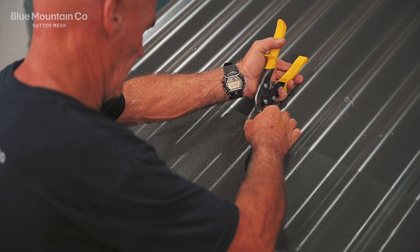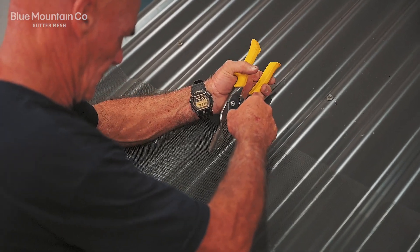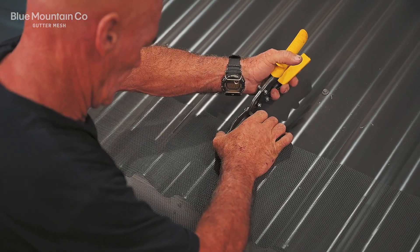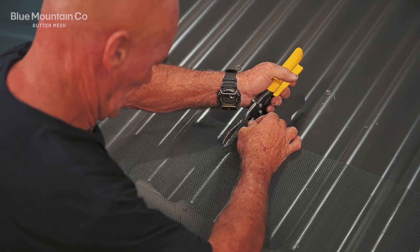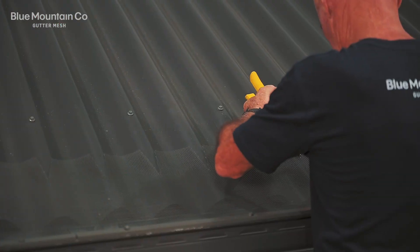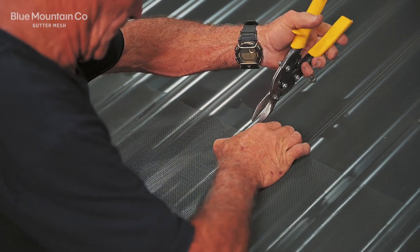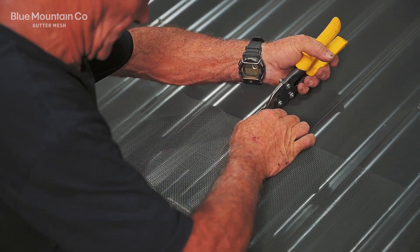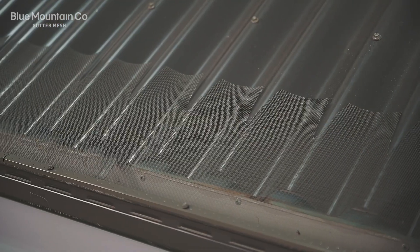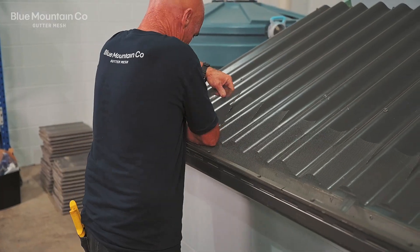Next, we're going to put a slit in the top of the mesh — you want it to be about 100 millimetres deep. You can either put just a straight slit, or as shown here, a small v-notch. A straight slit is probably a little bit better because that's going to help keep the screws really high up on that corrugated ridge of the roof once we put the screws in. The reason for putting these slits on the top of every corrugation is just to help that mesh conform a little bit more easily. You can see here what it looks like when we've put those slits in, or in this case some v-notches.